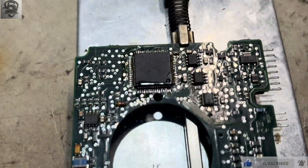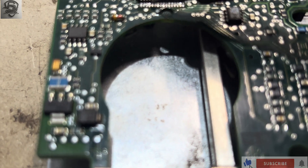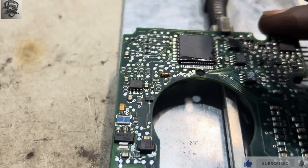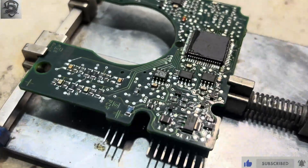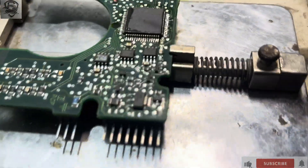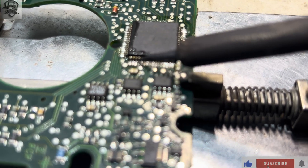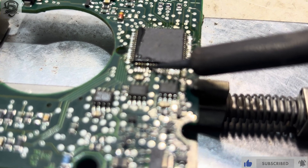The reason I still have to program this thing is that one may ask — is it not plug and play? No, this is not plug and play, because this selector lever has key hashes in it. In order for it to work, you need to program it. Either you have a version of this selector lever and you authorize it, or you take the processor — this 1D69J — out and read it. That is the only way you can program this type of selector lever.